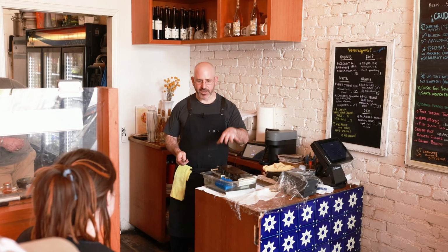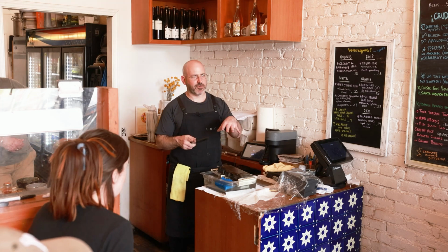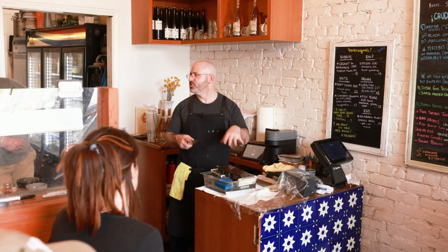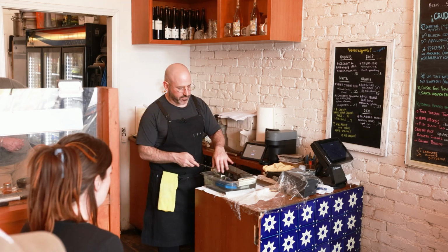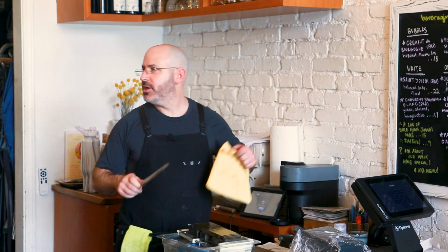Consistently, this has been the most idiot-proof way that I've taught burr removal. This works. And when I have to teach people on the other side of the world, like I have a customer in Germany or New Zealand, and I'm on Zoom, I do this because I'm confident that they will do a good job doing this. It's that effective. And blue sponges are everywhere. When you're done, just in case we did cause any damage, go back through and do maybe 1 or 2 stropping passes, and that's it.